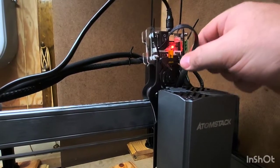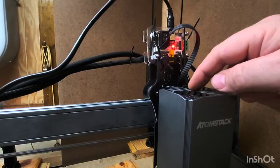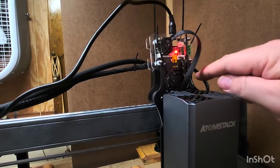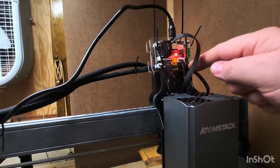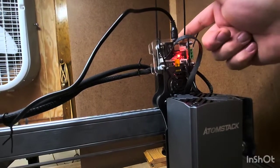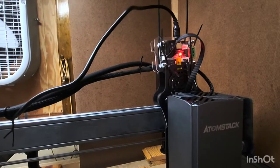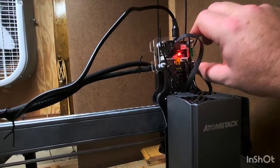For now, this is the best way I could see to mount this new circuit board. You've only got about a 4-inch wire harness to go from the circuit board to the R30 module, so it has to be mounted pretty close. There's a little open grill up here that looks like a fan — I ran a zip tie through there, and there are holes on the very back too. The circuit board is sitting down on the zip ties between the two roller plates; it took about three zip ties and it's in there pretty good, doesn't feel like it's going to wobble out.